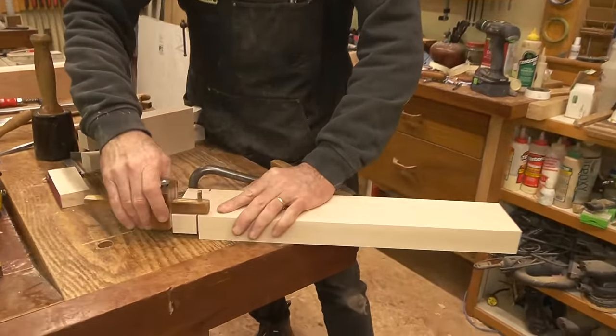Let's pop this on and see what we got. Beautiful. We're going to take out this material — don't get confused there. I've got a different depth; I'm not going this full depth. When this goes in, I'm only going in this step. I set up this marking gauge to just overlap with that, so it's going to register the depth of these tails. I'm going to set it right on there and scribe it across.